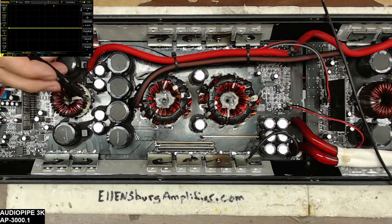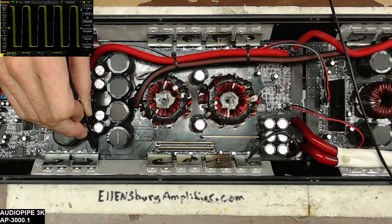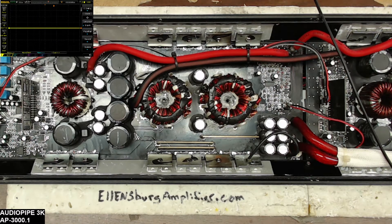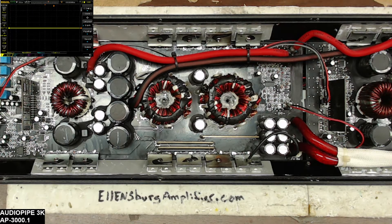What I did is I started checking around the gates of the transistors. On board B, for the rail to rail frequency, we have 184 kilohertz on the gates of the outputs. If you're familiar with these Type 4 boards, they should be about 147 kilohertz on the drive. Here's board A, which is at exactly 147 kilohertz. So that obviously points out the problem of why this side is running hotter — the frequency is too high on board B.